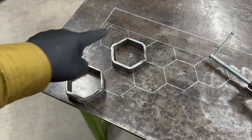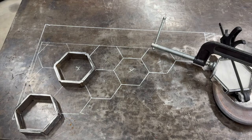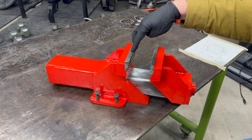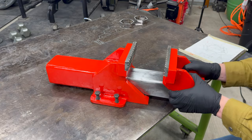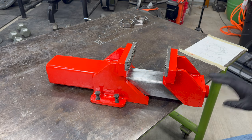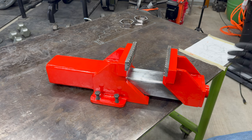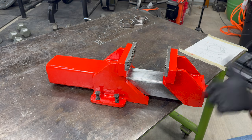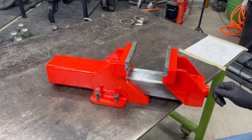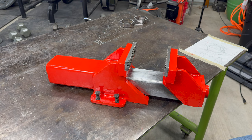It's a lot of work to make it look like this — I wouldn't do it again, but that's how it goes. All right, so here is the vice that I just built and finished the paint job on. I just put these jaws in here. We'll tighten those up, take the front plate off, grease up the threads on the drive thread as well as the main drive nut, then put the thrust bearings and the nut that holds the inside spring on to take out all the slop. Then bolt it all up together, bolt it to the table, and it should be usable — ready to rock and roll.